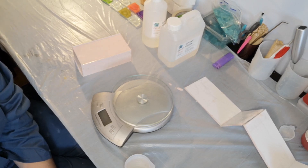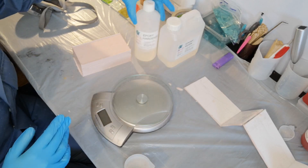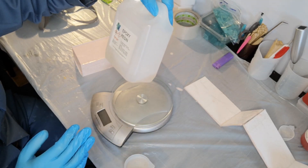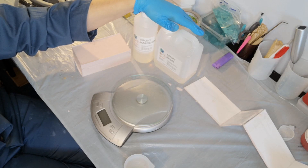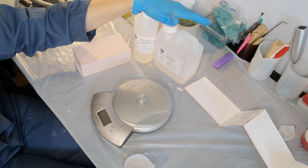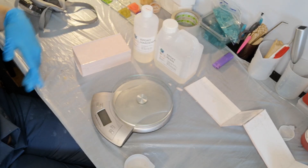I'm going to explain what I'm going to do first because with the mask on you probably won't be able to hear me. So here are my gloves, this is my mask. I've got my epoxy — it's from a company called Swindon Composites or Swindon Composite Supplies, I'll find a link. It's actually a coating resin, for doing tabletops rather than a casting resin for deep pours. I use it all the time — it's really liquid, so if you're an absolute beginner and you haven't got a pressure pot, this is a good way to go because it's so runny the bubbles come out super easily. Whatever you've got is fine — just know how yours mixes, whether it's two-to-one or one-to-one, whether you're going by weight or volume, and read all the instructions thoroughly.